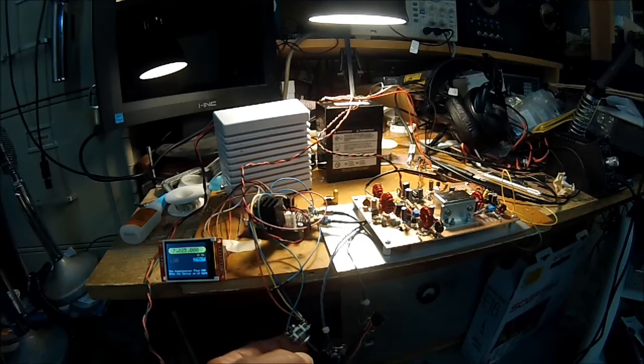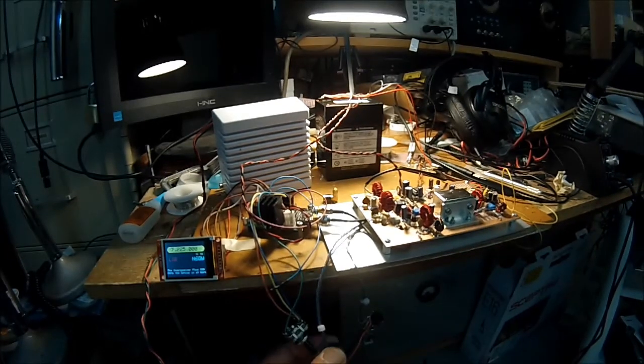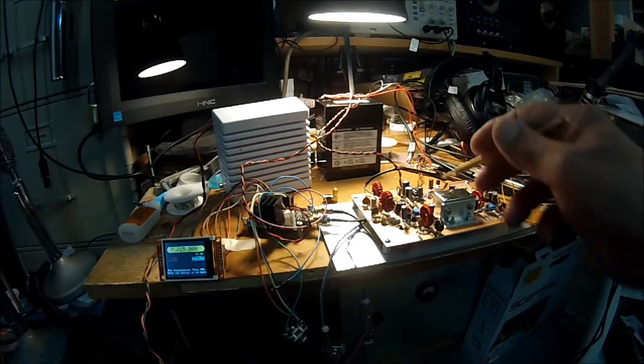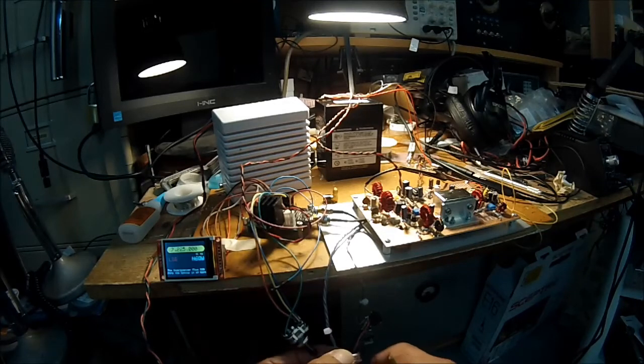I keep it on what they call a smart charger. Now the original version 1 had a little different audio amplifier. It had an NE5534 driving an LM380, so you get a little more audio volume out of the version 1. But in the interest of compacting space, I put the version 2 amplifier here, which is the 2N3904 driving an LM386. So a little less audio volume, but nonetheless pretty loud.